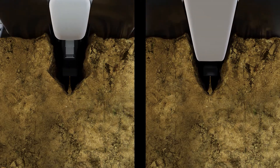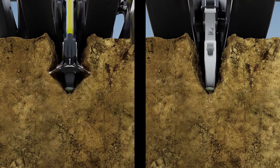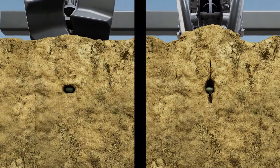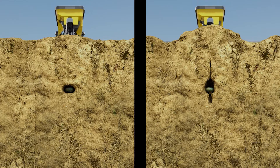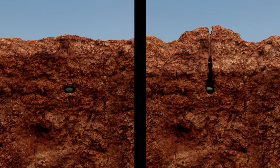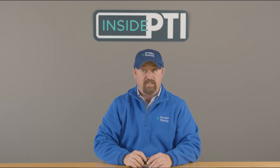The whole time we have sensors and we can control the pressure to keep this thing in the ground to do a good job of closing that furrow. It's all about real-time measuring, reacting, and controlling. When we're sitting in the tractor cab planting, we can look at the 2020 monitor and in real time get readings from our planter and from Furrowforce, telling us how good of a job we're doing closing the trench.